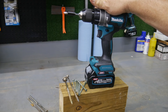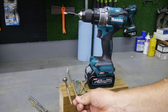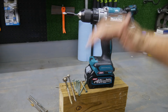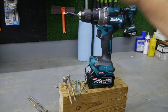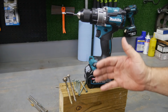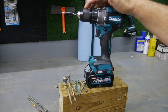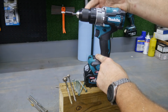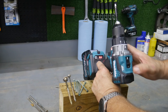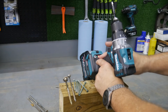We're going to take the Makita 40-volt hammer drill driver, the GPH-01, and drive some screws. We've got some three-inch deck screws as well as six or seven-inch construction fasteners. We're going to show the settings here on driving with the drill driver, which is a little bit different than driving with an impact driver. The drill driver has an advantage when it comes to setting screws into wood — and even metal sometimes — because you have these clutch settings. With this one we have so many, so we're going to turn it to driver mode and go into mode one, unlock it, and dial it down to one to start off.